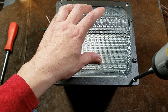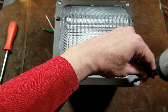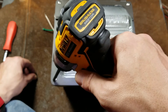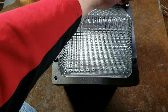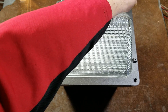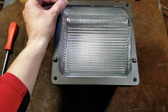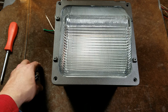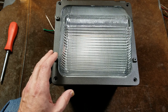Back at the workbench — one aspect of halide lights worth noting is that they are a point source, or theoretically a point source, with a huge amount of output. Also, a lot of LED manufacturers claim you can only get halides in limited colors, which doesn't make sense. You can find HID headlights all the way up through hot pink and purple — 12K, 15K, 20K colored lights. Nowadays they can figure out exactly the combination of metals to put into them.